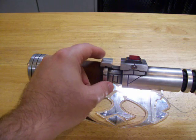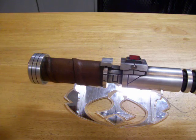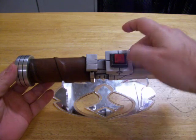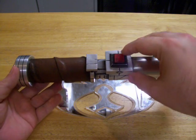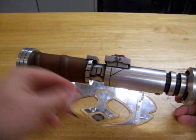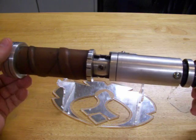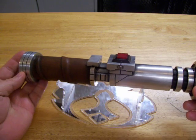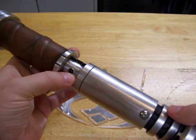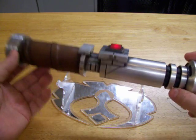This was still functional when I got it. Back here was the speaker. To change things around, this has got just a regular tactile switch now — it's one of the ones I use for stormtrooper sabers. And then there's another tactile switch here in the back. The recharge port's in the same spot. It had to be glued in. If it ever goes bad, it'll be real fun to tear apart and take out. Because the hole's a little bit too big, it couldn't thread to accept a mechanical hold.